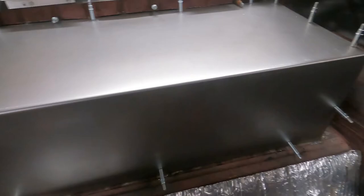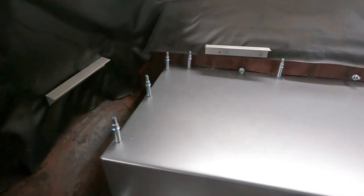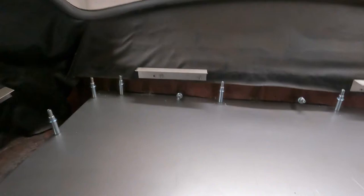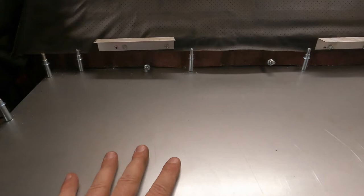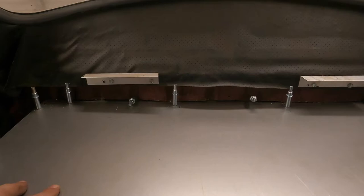So here it is — all the holes are drilled. We have everything pretty much in place the way we want it. It's really rigid. We'll add the dampening material — we got some Thermotech insulation, I'll put a link in the description and show you guys how I put it on. So now what we'll end up doing is taking everything apart, taking it out of the car. Because of the location of some of the rivets, I'll probably rivet some of it together outside of the car and then bring it in to install it.